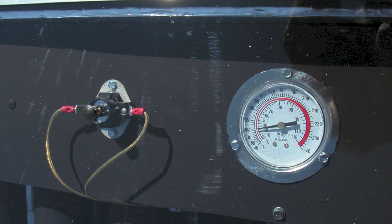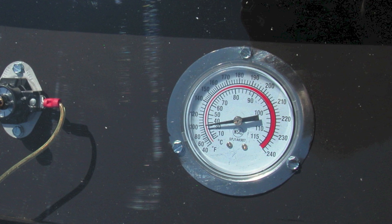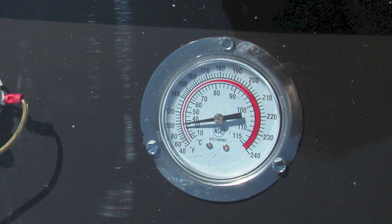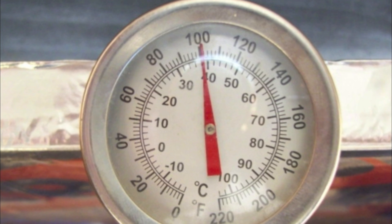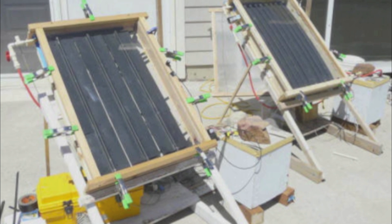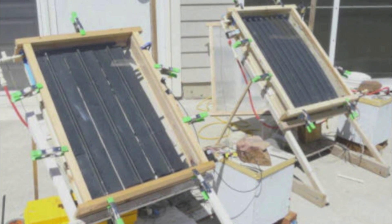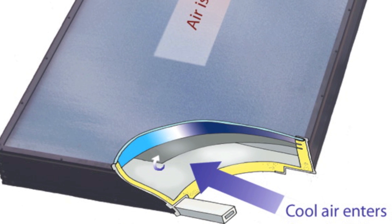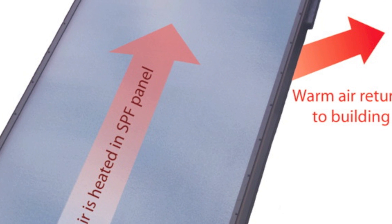So here's the moment we've been waiting for — this is when everyone on YouTube shows you the temperature of their collector. Even though I admire their enthusiasm, if you're just taking a stagnated temperature of a collector, it really doesn't mean anything. It's a rather complicated measurement. In order to really know the efficiency of a solar furnace, we need to have air flowing through it and know how many CFM of air is flowing. You can have a collector that's very, very hot, but once you start blowing air through it the temperature dives down very quickly and you realize it isn't absorbing much heat. Or the opposite — a very hot collector that when you blow air through it doesn't actually transfer the heat from the absorber into the house.